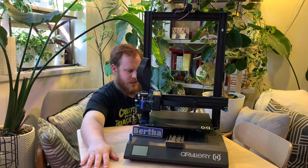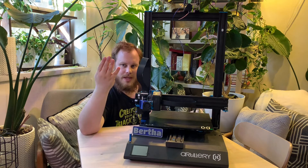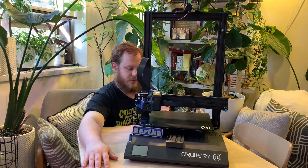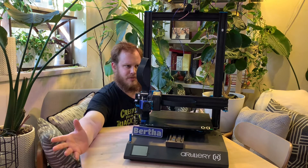In practice, it's not that perfect. It's taken a bit of practice and trial and error to get it to work, and part of that was getting the Z offset set perfectly. There are also some weird adhesion problems and cleaning problems. Eventually you will need to clean the bed. You do need to clean it to remove the little bits of plastic and the film that gets left over from prints, especially if you remove the print before it's completely cooled and popped off on its own. You'll actually hear a crack — that's the sign the print has come unstuck. If you remove it before that, it leaves a film.